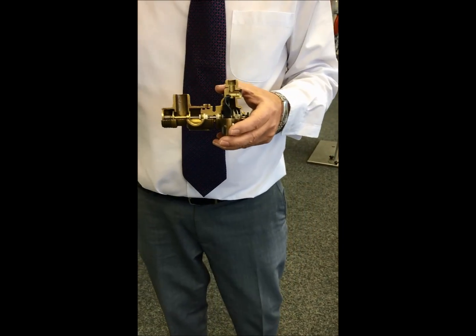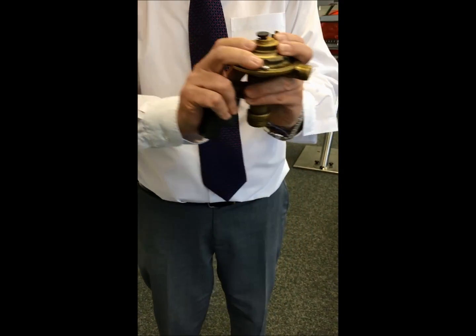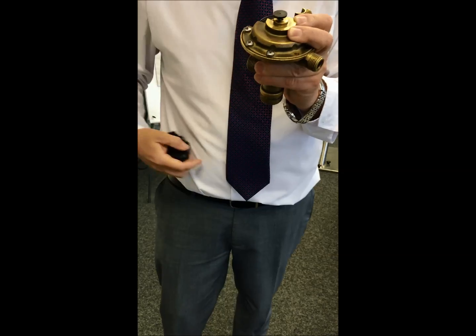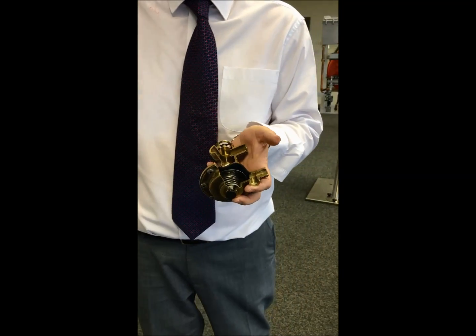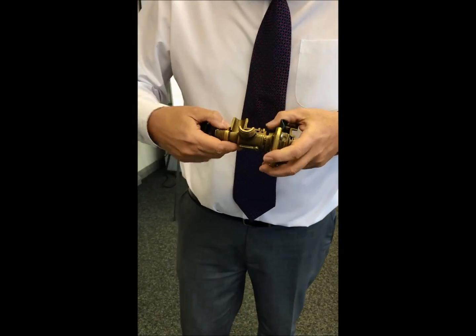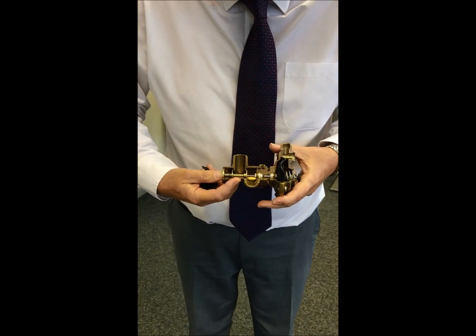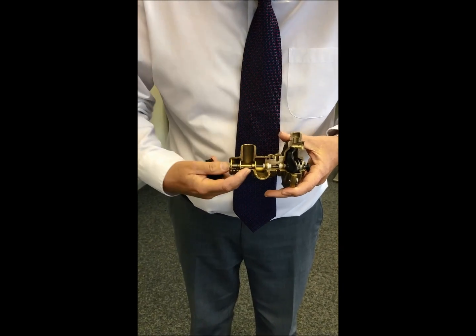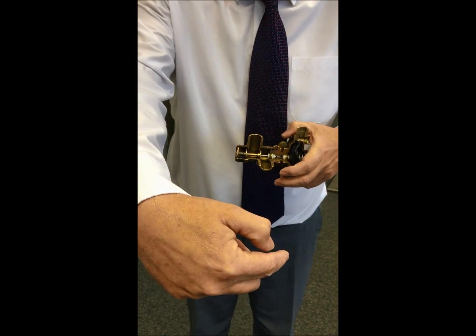So basically, when Mrs. Smith opens the tap, the diaphragm moves, the plunger moves, and it hits the micro switch. When it hits the micro switch, all that's doing, guys, is moving it from a lower burner pressure central heating to a higher burner pressure domestic hot water. But as it does that, at this part of the valve it closes down the heating section on domestic hot water there and opens up the bypass here to supply the plate.